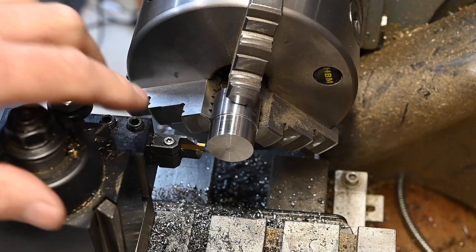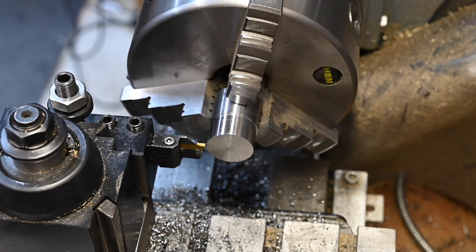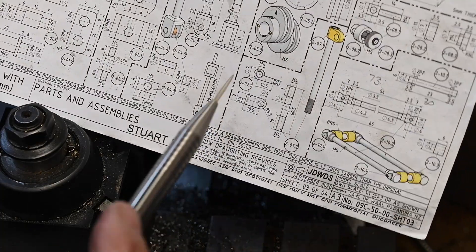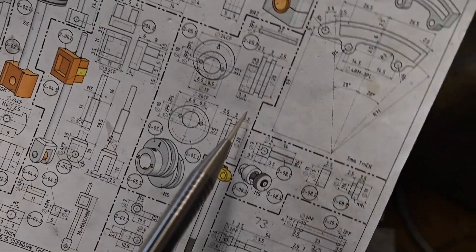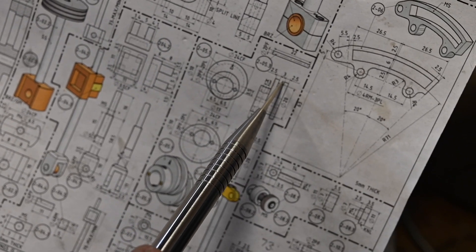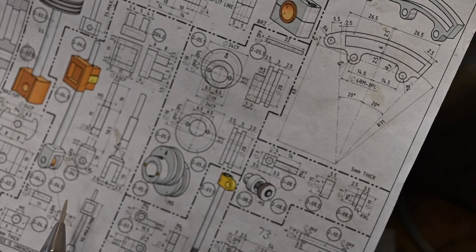Right, on the money. Same again — over three millimetres, back half, forward half. What I'm doing initially is putting in this three millimetre grooving here. I'm going to come over with the edge of the cutter which is now on the face, come over three millimetres, cut the depth of the groove, and then go back half a millimetre and forward half a millimetre to give myself a three millimetre groove.